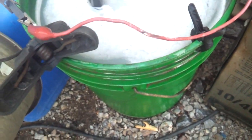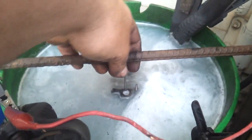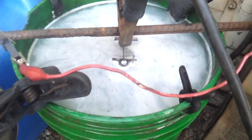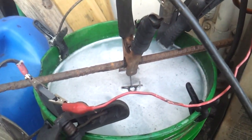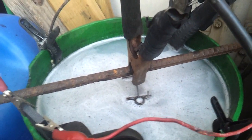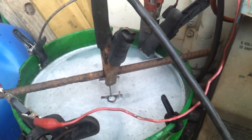This piston is out of a John Deere and it's already been in here once. I wire brushed it a little bit but it wasn't clean enough and we couldn't get anything loose — it just wasn't good enough. You'll find a lot of times you will have to run your part twice, maybe even three or four times depending on how rusty it is. But I have cleaned parts in this bucket that looked beyond usable, and once they cleaned up they were really nice parts. This is a way to save a part that's been deemed unusable.